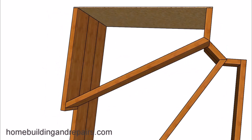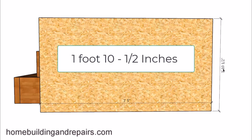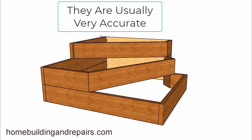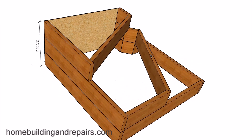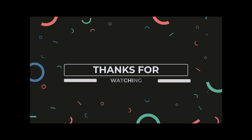For the upper step we will have a 30 degree angle here and 30 degree angles over here, along with an eight and eleven sixteenths inch board from this point to this point. From long point to long point we're going to have three foot nine and five eighths of an inch, and the point where this board dies into the structure is two foot five and three quarter inches. The back piece will be a plywood panel three foot five inches wide and one foot ten and a half inches tall. Keep in mind that I took all of these measurements off of this model and have not verified any of them. If everything does work, feel free to let us know by leaving a comment. Thanks for watching — check out our other videos on YouTube or visit our website for a complete organized list.